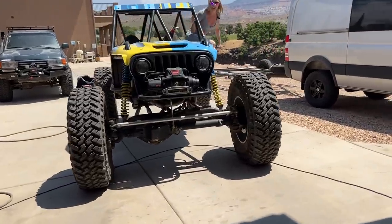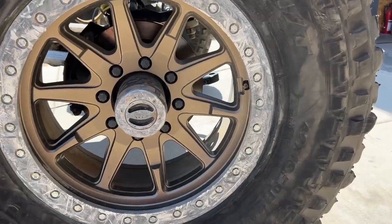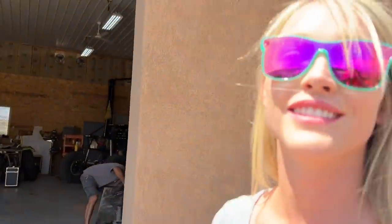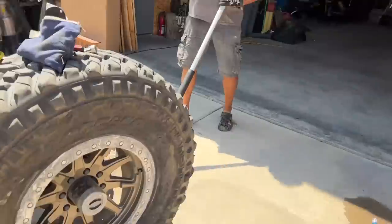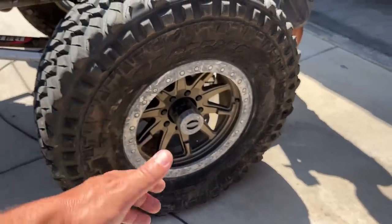First things first, we are taking all the air out of the front tires. And as you can see, we're going to do it to hub height — so right here, we'll do one at a time. Then you just fill it up with hose water, at least for the summer. We live where it gets really cold, so you're supposed to do beet juice or something that doesn't freeze. A lot of people have a lot of options — antifreezes, some sort of tractor fluid, or tractors use beet juice. For now we're going to fill it up with water, and later we can put the valve stem on the bottom, let it all drain out, and then fill it up with the other stuff.